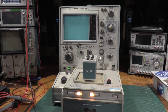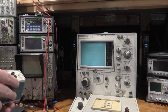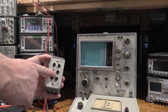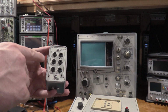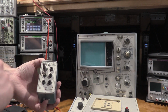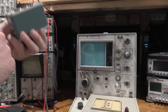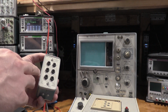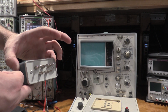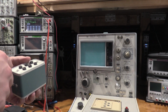Move over to the 6500 and I'll show you what's going on. It turns out the way these load resistors work is you have collector and base loads on the test terminals. When you have the shorting bar in this position, it's supposed to put a 0.25 ohm load across the collector. This is also done in 4-wire sensing, so we're dealing with some very small resistance, but an incredibly high wattage. Makes sense.